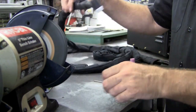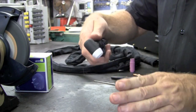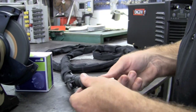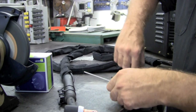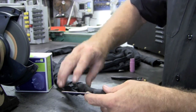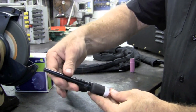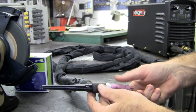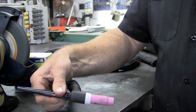Let me show you how to build the torch. Here's the torch and torch trigger — it's adjustable on zip ties so you can position it however you choose. We have the collet body, which just screws in. All these parts are interchangeable with Weldcraft, so existing Weldcraft components will work. Match the collet to the tungsten and drop it in. Since I'm welding on the table I'll use the long tip, screw that down, and add the gas cup last. Then adjust the tungsten for depth and stick out.